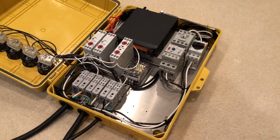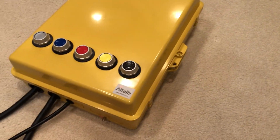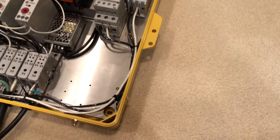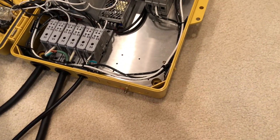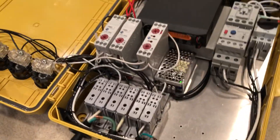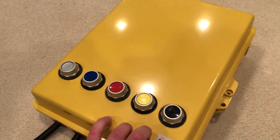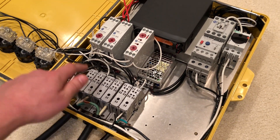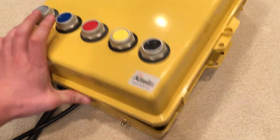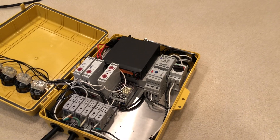Now that we have a basic idea of the layout, I can show you how the switches work to actually activate the thing. These buttons all get power from the input block and each go to the respective items they're intended to activate. Silver just bridges the neutral gap to the motor starter — it closes the circuit directly to the contactor, not hooked up to any of the relays. The blue alert button closes a circuit for the electrical pulse needed to activate the electronic timing relay for the alert cycle.